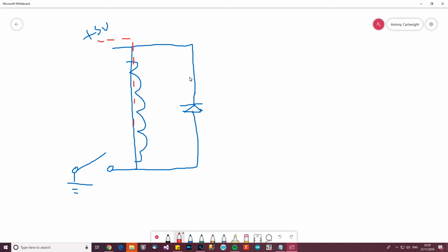However, if the coil is not powered anymore, in other words, that's opened, something different happens. I said earlier that a huge voltage is induced, but that huge voltage is negative biased. So here it could be, maybe, 120 volts. It could shoot up to that if we were not to snub it in some way. But actually, with this diode in place, it would never get to that. It will go like -1, -2, -3, and then over here it will be balanced out automatically. So I'll try and show you how.